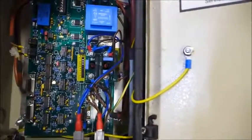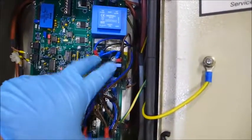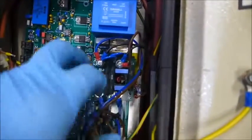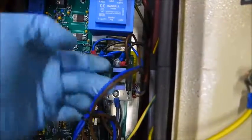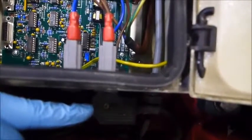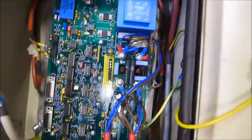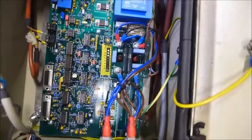Moving on over here you can see where the power comes into the box - this big gray wire screws down to the thyristor underneath. From there we have two jumper wires coming back out, blue and brown, and they come over to the little fuses or circuit breakers. The output of those goes to a plug on the back of the box, which ends up going back to your cabinet to power it. So we have to hook all that back up - just a quick overview of what's involved. We're going to disconnect everything, pull the PC board out, and go from there.